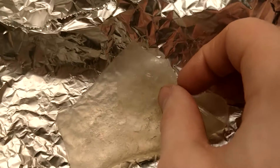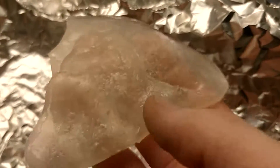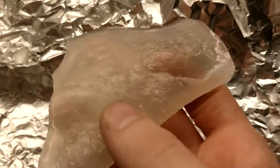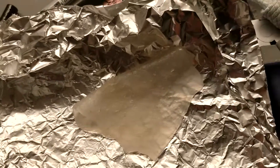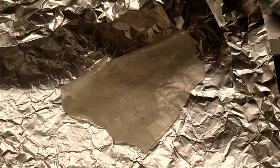Something I want to do in the near future is make a thermoplastic starch that's a little bit firmer, harder, and more rigid. Off camera, I actually added a little bit more glycerin to the mixture, and I think I could have put in a little bit less. This is a good masterbatch, but if I want to make something structural or more rigid, I'll need to use less plasticizer in the future. I may also do some solubility testing of this material.